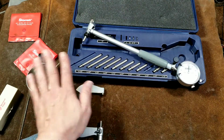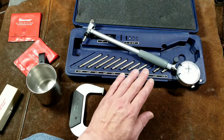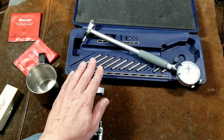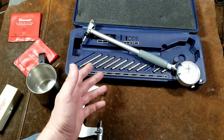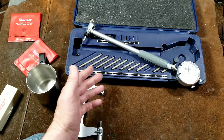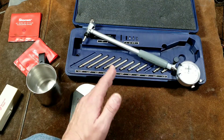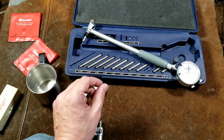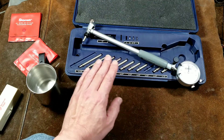I'm setting the baseline of this at two and a half inches, and then this would help tell me plus or minus the sizing of this relative to two and a half inches. So instead of measuring in thousandths of an inch — that would be 2,500 thousandths of an inch — versus going plus or minus 25 thousandths of an inch. So it's a much more narrow range, and you get a much more accurate reading once this is set up at a known value.